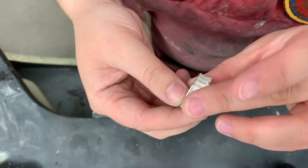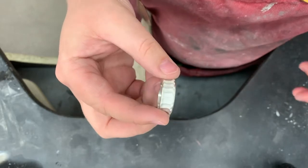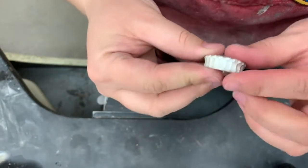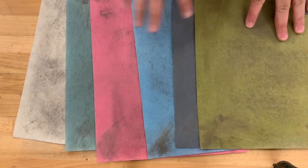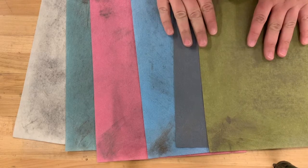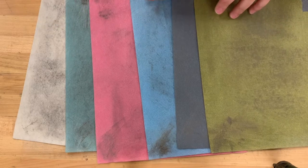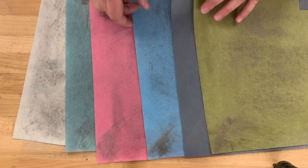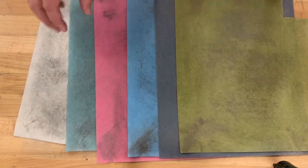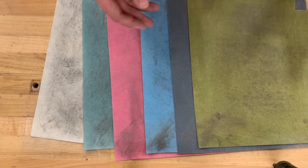The last thing I'm going to demonstrate — and this is not something you have to do at all — I'm going to grab some polishing papers just to show you what they look like, and I'm going to lightly polish my ring a little bit with them. These are the polishing papers. They're really thin and feel almost like cloth. They're not as abrasive as sandpaper. If you order the pack that I'm putting in the description — again, totally optional, I do not expect you to polish your ring up for critique — but I just wanted to take this opportunity to show you a traditional way of polishing rings without using a buffing machine.